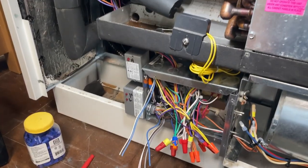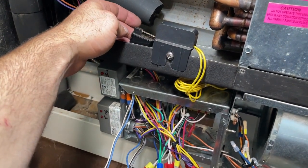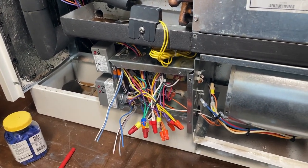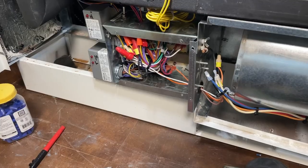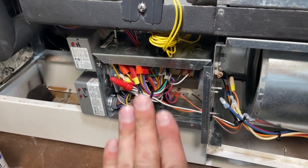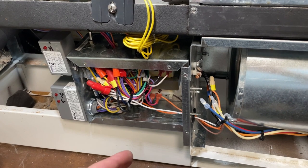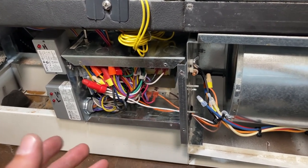It's going well. I went ahead and fixed this drain. It was this drain switch, it was up too high, but it's right about right now, so I like that. I'm gonna get everything nice and neat, and then we're gonna test the operation. Got everything tucked back up in there. I like to face all my wire nuts up. For one thing, if they happen to come loose, they're not gonna fall off. And also, especially outside and things, it's just overall best.